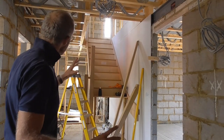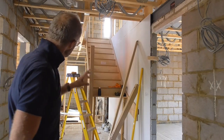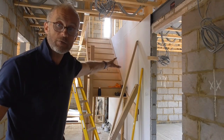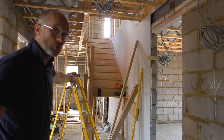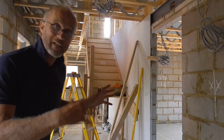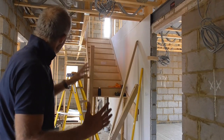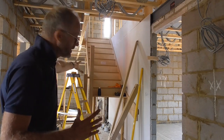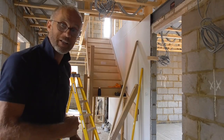Right, I've got everything ready. I did the drilling off camera because I was in a hurry. I've drilled out the tenons for the handrail and the tenons for that double newel on the bottom there. What I'm going to do now is larrip it all up in glue - I've got to be quite quick because otherwise the glue will go everywhere. I'm going to glue the top, glue the bottom, get this bottom newel in, get all the dowels knocked in, and then we can have a clean up.